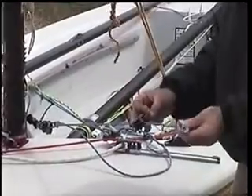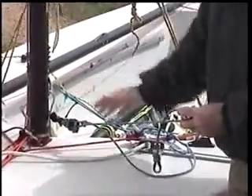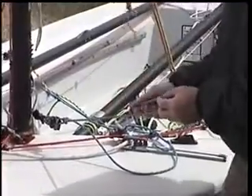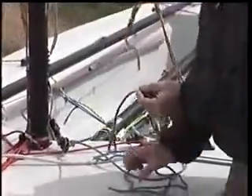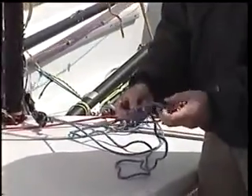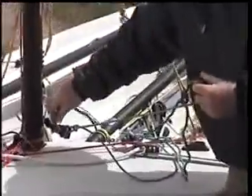This end is going to be attached to the boom. The easiest way to string this up is to attach that end and leave it fixed to something — it doesn't even have to be part of the boat while you're trying it out. Then we feed the other end up through the loop, so instead of just two pulleys we now effectively have a third one as well. We go up through there, then back down through the block at the bottom, and there we have our first purchase.